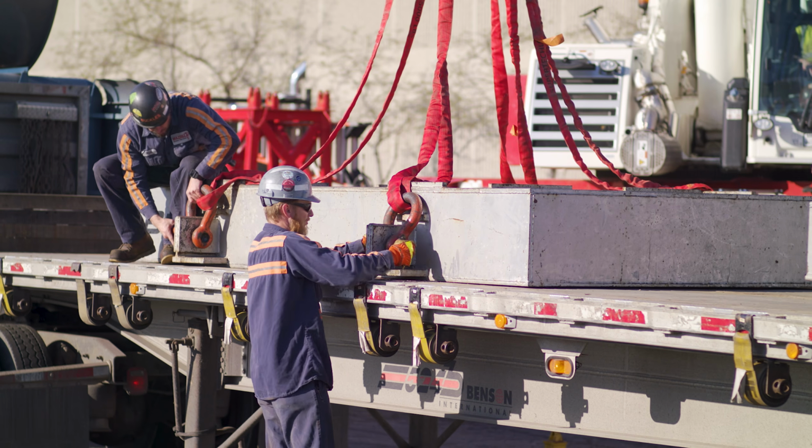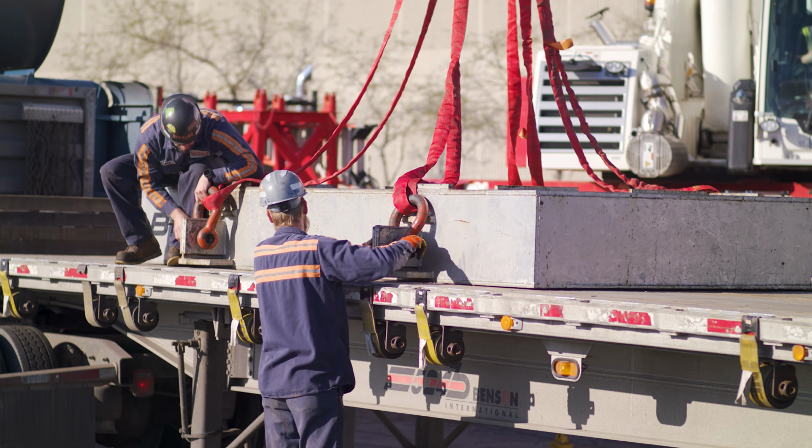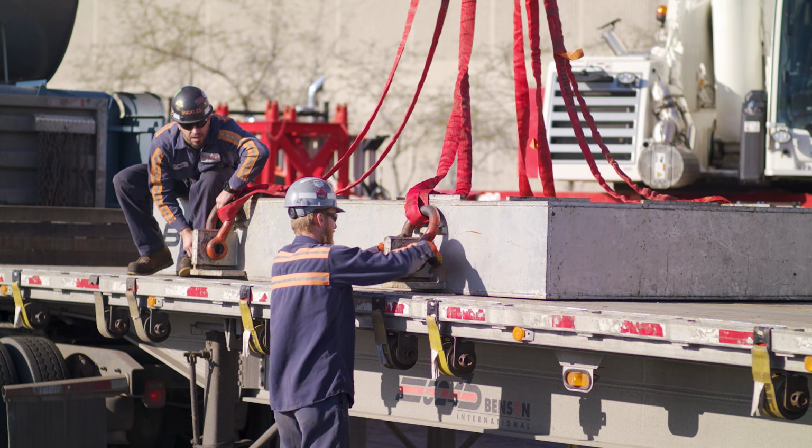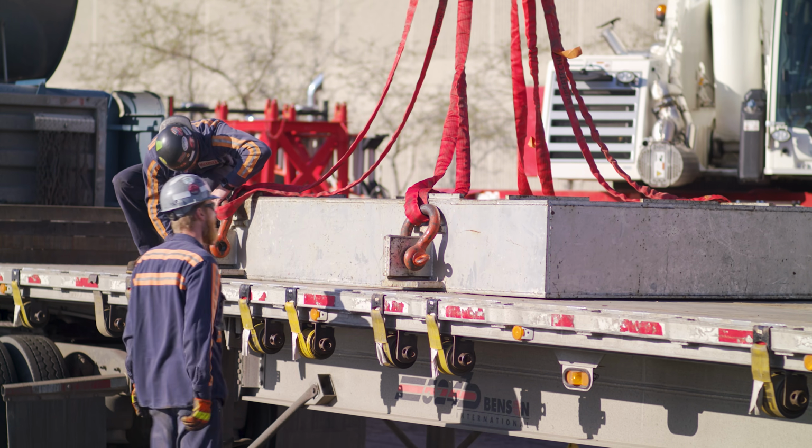The reason why you don't want to back it off is that you actually leave a little bit of a gap there. It might be only a couple thousandths, but what ends up happening is a lot of times when people pick things up with a shackle, the load might go to one side or the other side. We call this the spread, this opening. When that happens, you could potentially bend this ear out. And the reason why that happens is because you've given it somewhere to go.